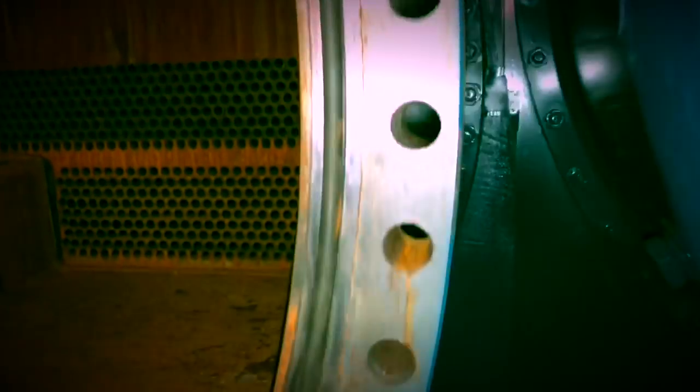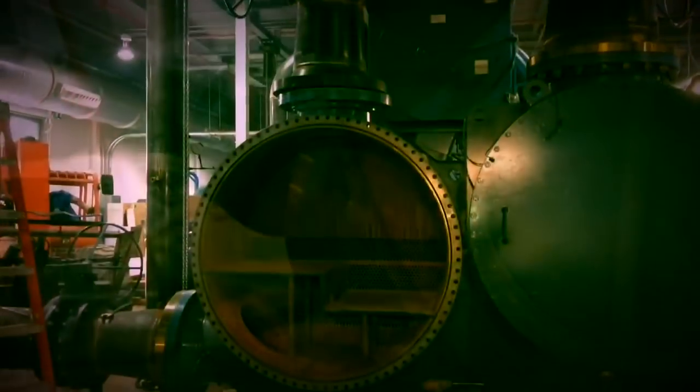This is inside the marine box. The hardest part is getting to these bolts in between the marine box and the condenser head — there's only about a 4-inch gap, so all I can do is get a ratchet and socket in there and sweat it out. We finally got that marine box back on and tightened up. We're going to let that gasket relax overnight because I have a feeling it's going to loosen up some, and we'll re-torque it tomorrow to manufacturer specs and then get that cap on.